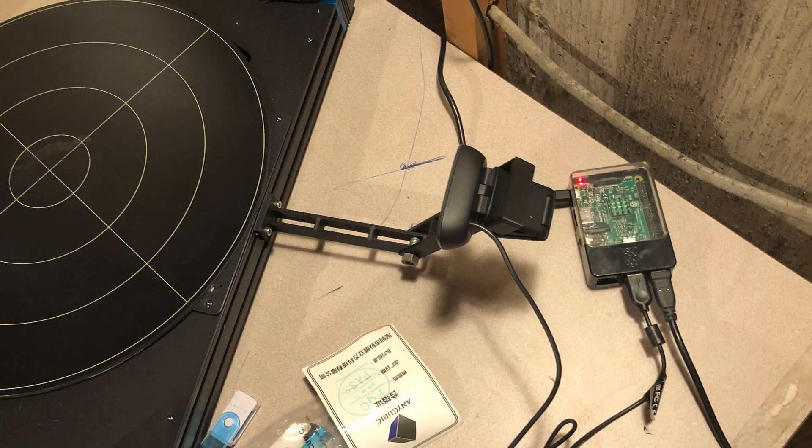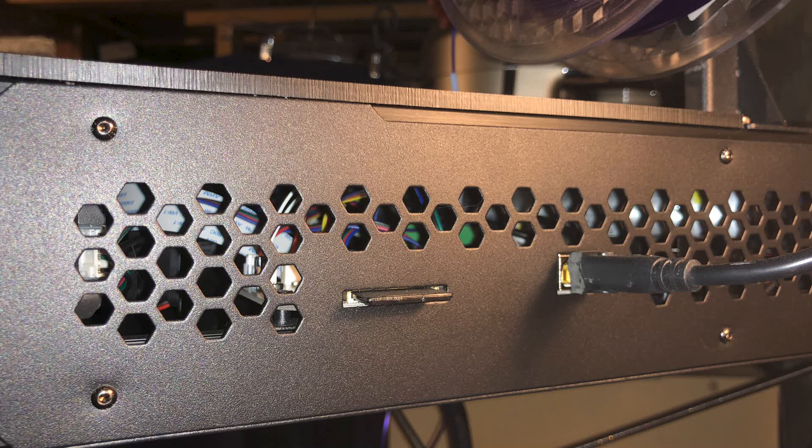As you may have seen in some of the B-roll, there is a Raspberry Pi sitting right next to the Predator. Yes, OctoPrint works out of the box with the Predator. There's stuff out there saying it doesn't connect, but I plugged it in and it connected at 115,200 baud — the auto-connect found my USB. I made a camera mount and stuck it on the side. I can fully control the Predator through OctoPrint. It also has an SD card slot on the side of the machine, giving a great user experience.